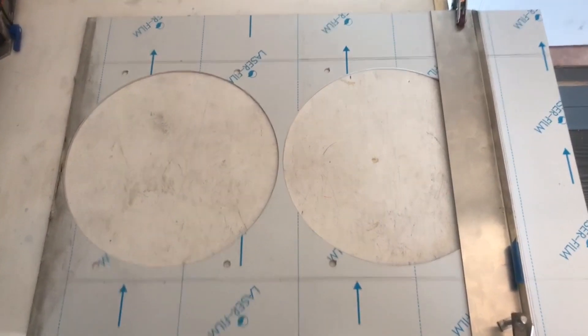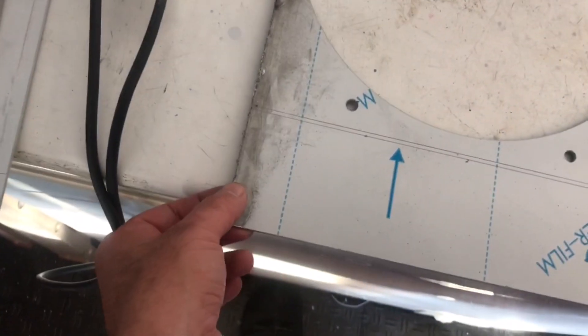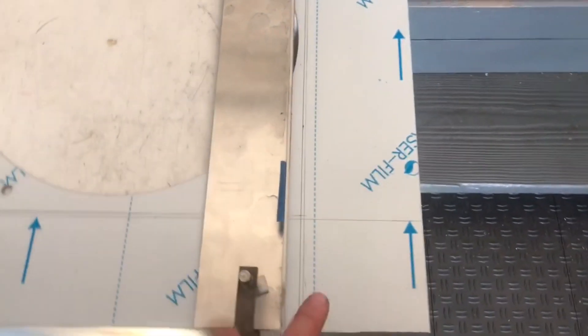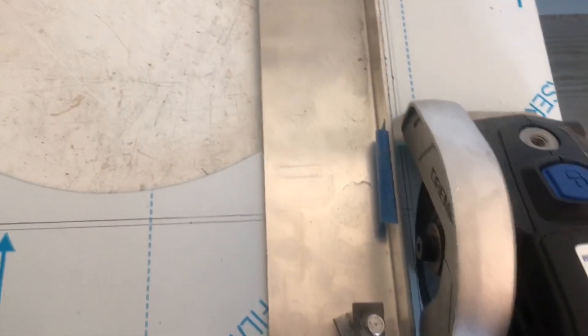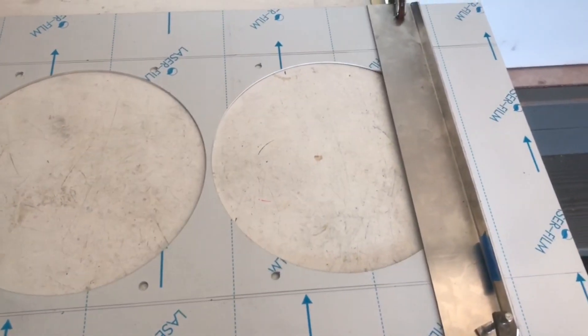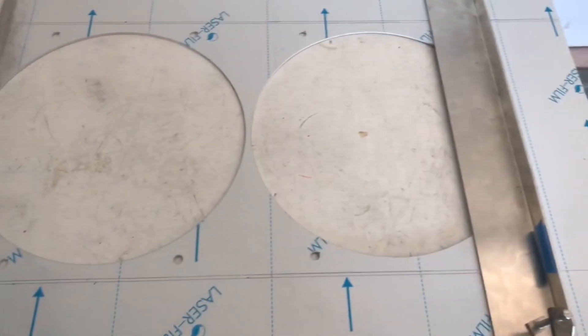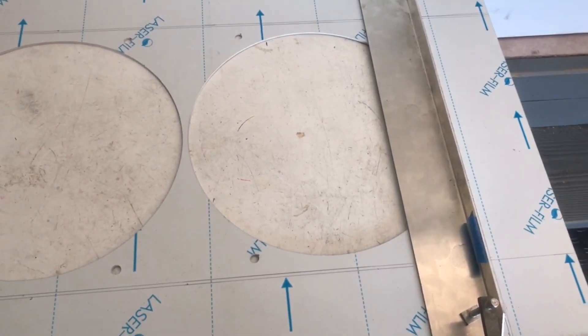Here's a little work in progress. I cut one side off and this Ultra Saw is beautiful - beautifully straight, just a little sanding and we're done. The way I did it was I used one of these angle irons to create a guide. The guide presses up against the sheet and I get it perfectly straight. So if you don't have a table saw and you have enough room to clamp a guide on your sheet metal, that Ultra Saw works really well.